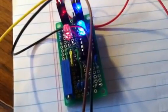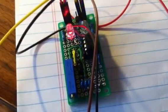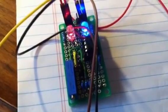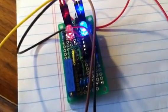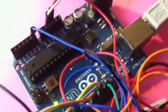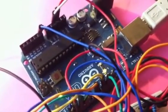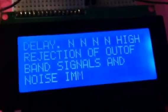This is a little video showing the tone decoder board I built using a 567 chip. It's set up to decode a tone — it's listening to the computer generate Morse code right now. The output from my board is going into my Arduino, and the LED on the Arduino is blinking just the same as the Morse code you're hearing. That Arduino is running a program I've written that copies the Morse code and displays it on this LCD display.